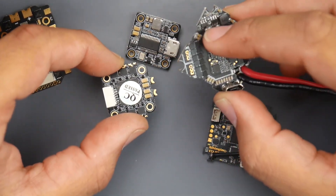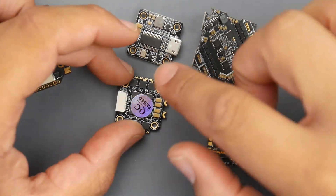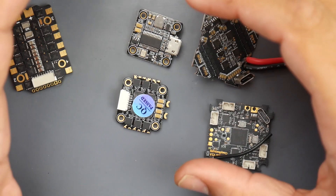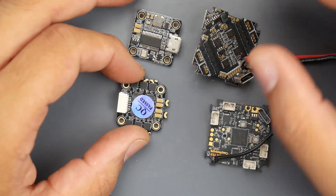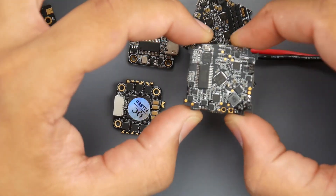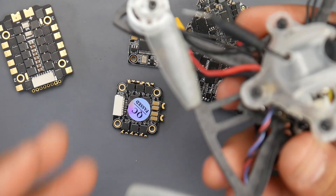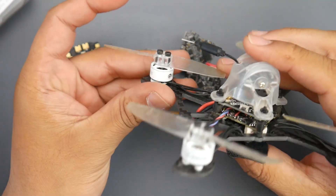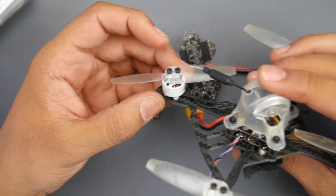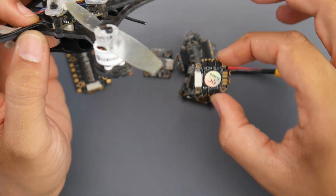This is why these newer boards are really great for high-demand quadcopters and for crashes, because crashes are where you have the highest voltage spikes and in-rush of current. A big FET can dissipate and handle that just fine. Here's the Crazybee 2.0 — I'm not saying these are bad boards — but it's not recommended to put something very power-hungry like the Eachine Twig with 1105 motors and big propellers on these. That's going to need a lot of current going through it.